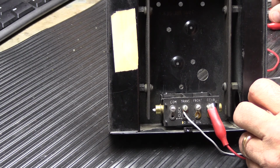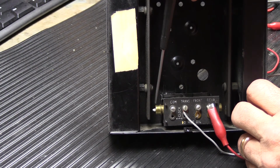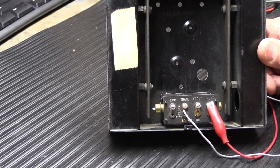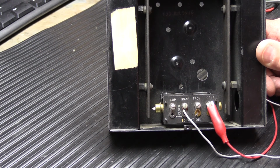makes a single note, and then as soon as you let go of the button and this small coil turns off, the spring, which has been compressed, will make the plunger go back to the right just a little bit so it's ready to go again. And that's basically how it works. It's very, very simple, but it's also very, very specific in how it works and how it has to go back together, and all the pieces have to be the right size and the right length.